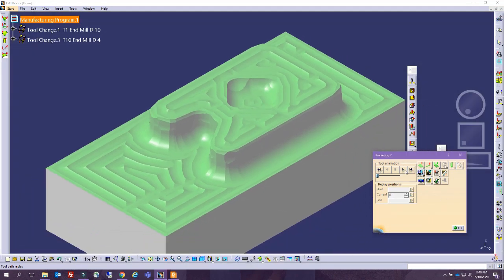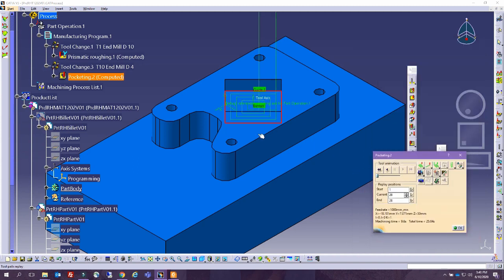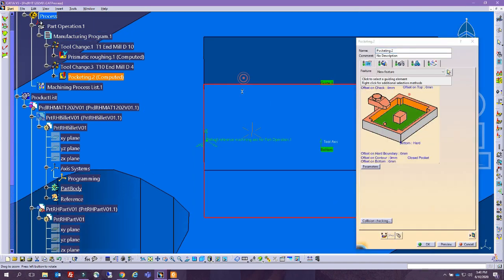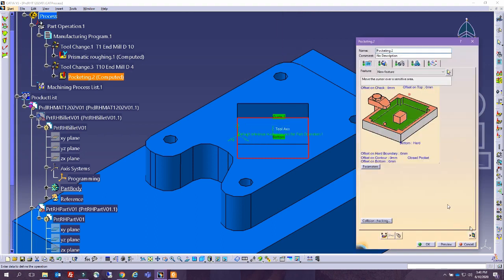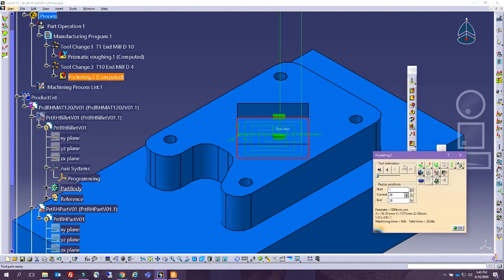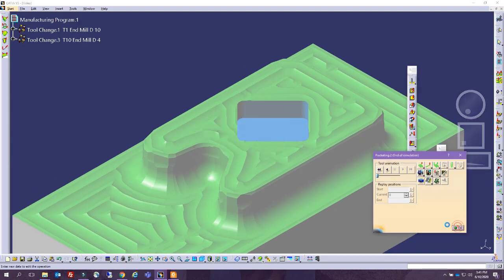And so we have this first stage, and now we're going to, okay, perfect. This is good. So we did this pocket. Now, of course, you're comparing. Let's go ahead and zoom. The tool is going to come along this orientation, and the tool is cylindrical. So no matter what, we're going to still be left with a fillet in here, whether the designer does it or not. And it really depends. If you really want to remove it, you have to try to use other operations, because milling, especially when it's closed from this orientation, will not get you there. I forgot to save the video, so let me make sure that I play again and I associate the video with this result. All right, perfect.